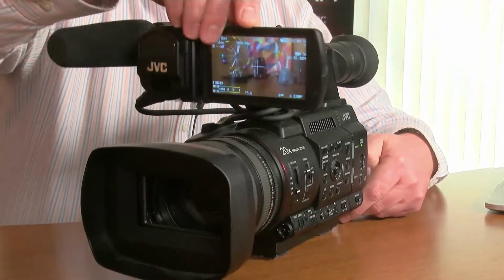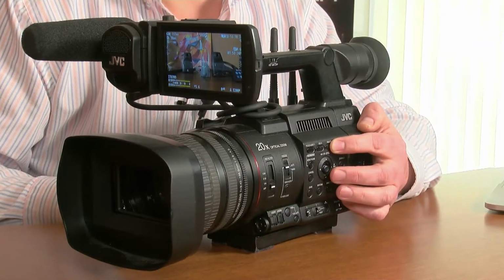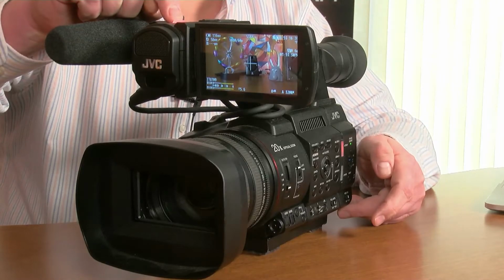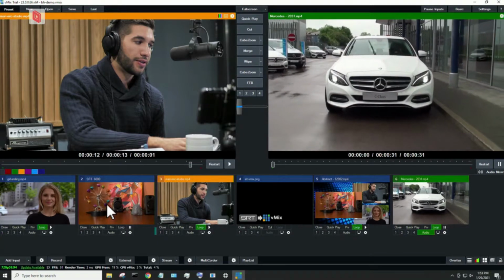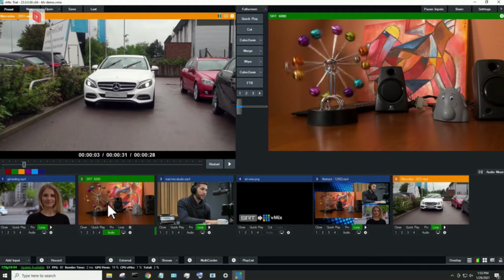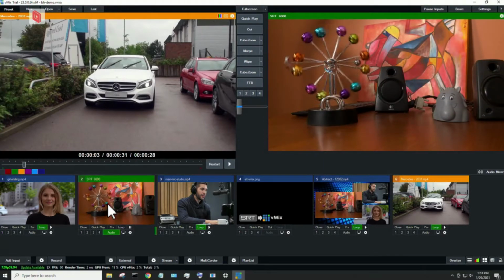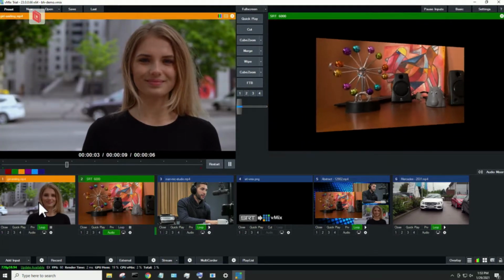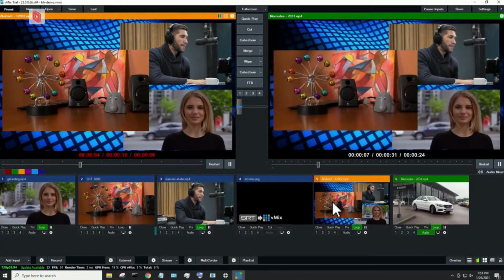So all I need to do is press the online button, which is located right here, and video will appear in the switcher. So I'm pressing the online button. Tally actually goes on, so you can see the tally light here. And now when I switch back to my switcher, you see video is already available as a video input. And this is live video from my camera right here, with a latency of about 1.2 seconds in this case. And this video appears as a regular video input for the video switcher. You can always switch it to any other video input. You can introduce special effects with this video.